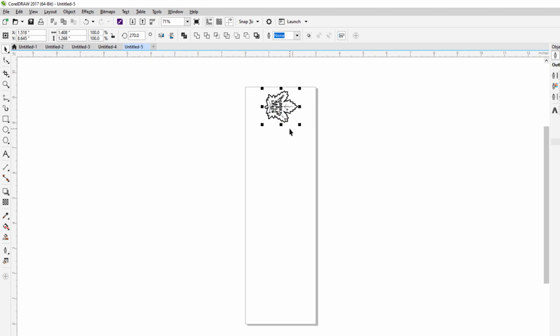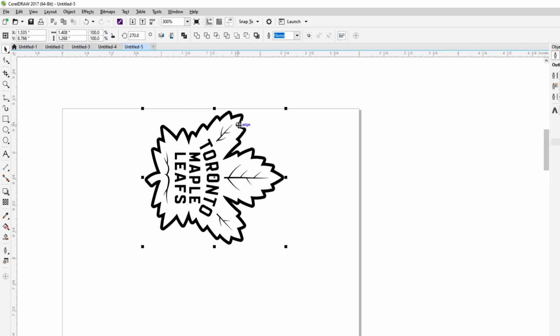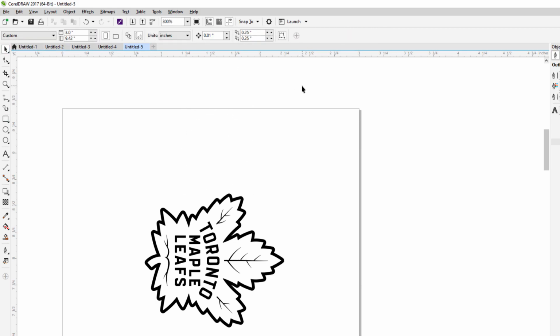Now, if you're doing a wine glass, then normally what you would have done is I would tell people, put it right up here at the top, and what will happen is it'll start etching right away. Just as if we're working on a flat table, if I had this on the top left-hand corner or against the top ruler, it's going to start engraving right away. And the rotary machine is exactly the same. If I bring this logo down here, then this area right here, that area there, is the actual movement of the glass before it starts etching.